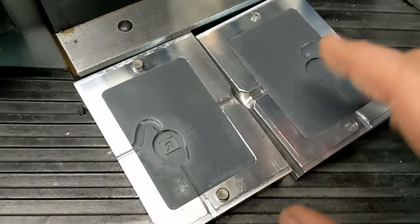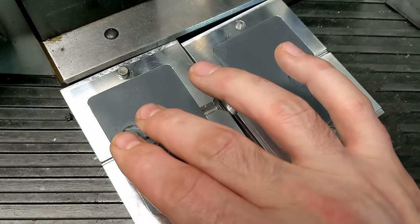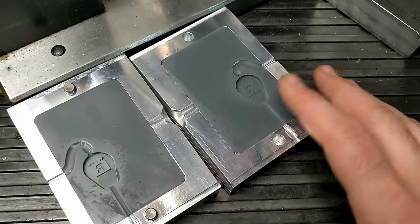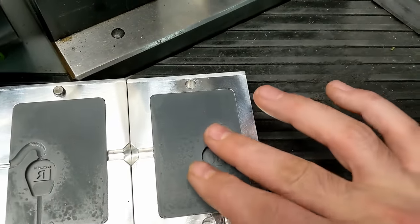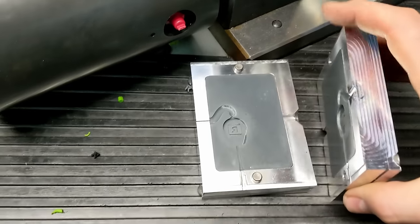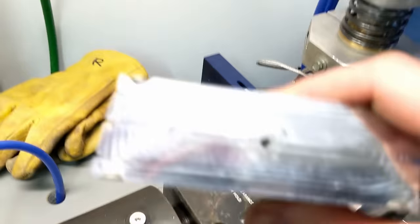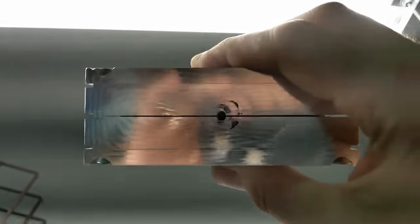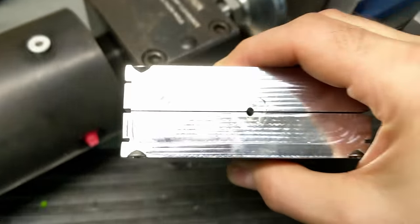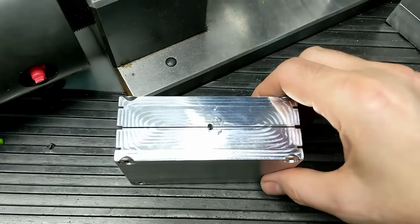One final note: we did start to notice pretty radical warpage. The mold started out totally flat and flush together, but right where it was receiving the most heat is where it started to bloat and warp up — here and here. So when you mate these halves now, there's a high center right at the center of the cavity, and it's kind of teetering back and forth.